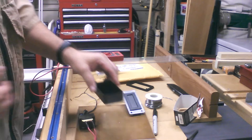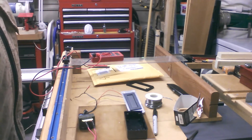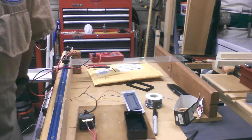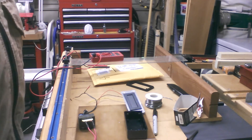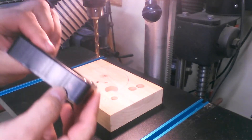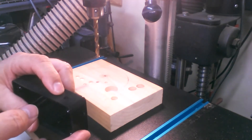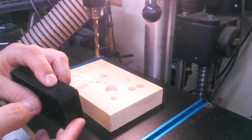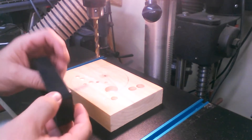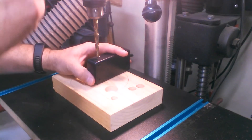I think it's going to look nice. I've also changed my mind - I'm going to make it a permanent mount on the lathe, just because of where it's going to go and how it's going to be wired. So for the next step I've got to do some hole drilling. I've got a mark here - this is where I want the hole. I'm going to drill a hole in the sheet metal cover on the lathe as well that will line up with this - these will be where the wires go through. I'm just going to drill this out with a 3/16 inch drill bit.